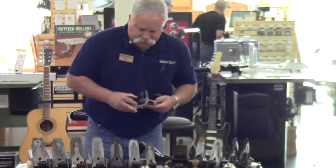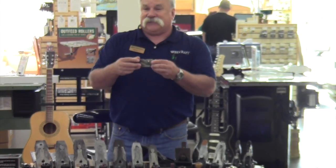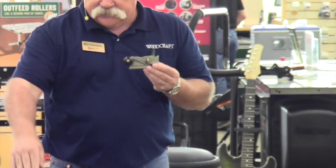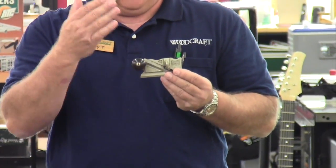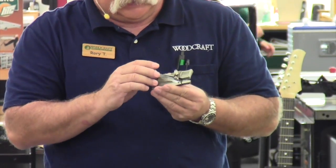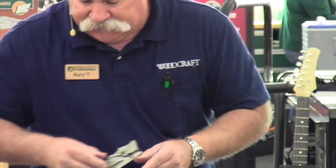And along that same line, this is an edge rabbet plane, okay? You're working the bottom with this one, the bottom of the dado or the bottom of the shoulder. If you want to clean up the side of the shoulder, this is what you use. It's got a depth stop and a cutter that'll smooth the side of a dado. Really a nice piece of gear.